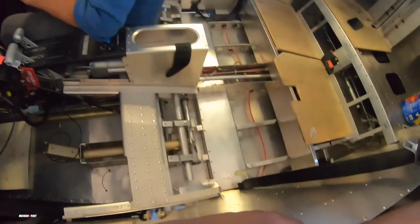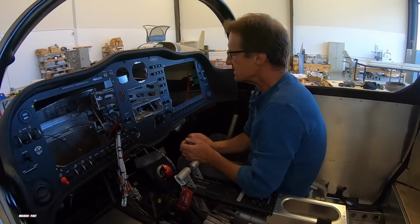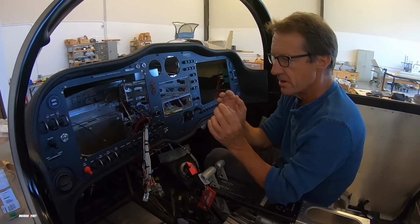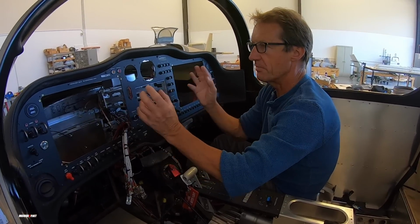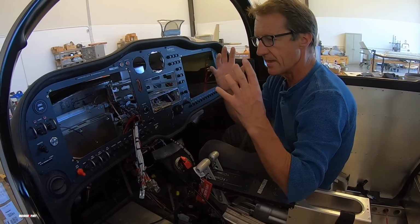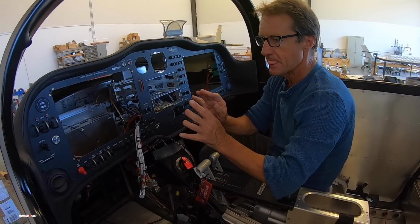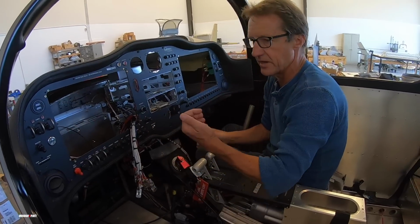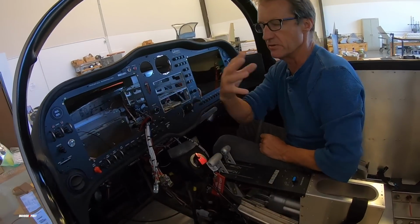Right. Basically, the Rotax iS engines are extremely sophisticated, refined machines. And so what they do is they don't give you an engine and expect you to wire it up to make it work. They give you the sophisticated engine with a computer system, and they give you a full, very high quality wiring system. And basically you have a few wires in those plugs that interface. It's to switch the engine on and off and to start it, and to give you ECU information.